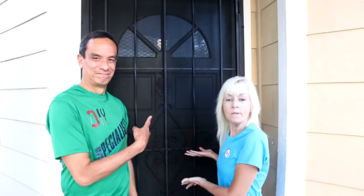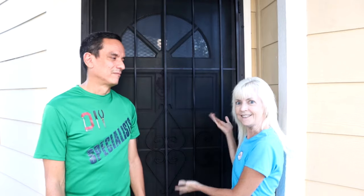Here is the final result of our screen door. This was actually an afterthought — we first wanted to start with our front gate, which started peeling and getting rusted. We found out it peeled because there was no primer put on before we repainted. So we finished off with the gate, which looked beautiful, and then decided to do this screen door as well.